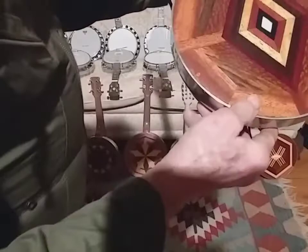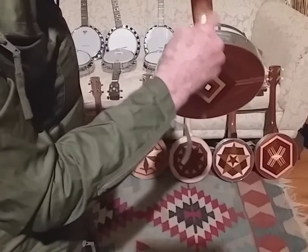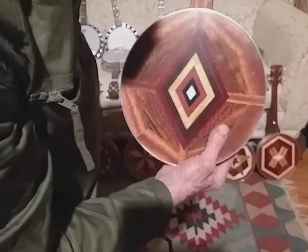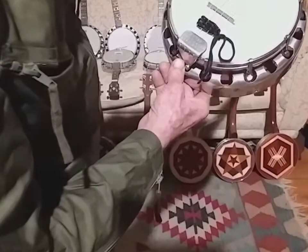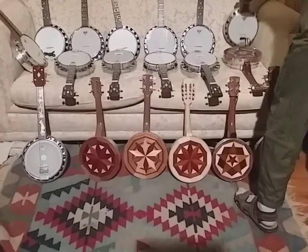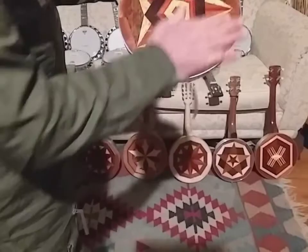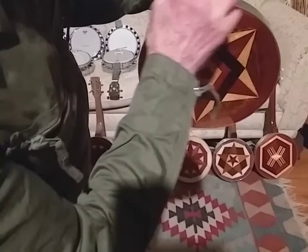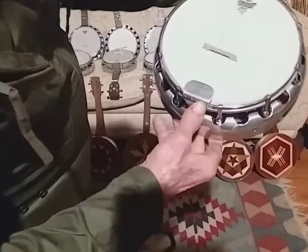This one's called the diamond, and I do love these patterns. I've done some of it a bit skew-whiff which has made it look good. You can see this one really well with the grain — where I've sawn a piece of wood and they're opposite against each other, so if one wants to walk that way and the other that way, it stays where it is. This one's June 2013. This one I've called the ugly because I can't stand that pattern. You can see where I've laminated two different bits of wood together to make the neck so it won't warp. On this one I've put a thin bit of rosewood instead of ebony. This one's July 2013.